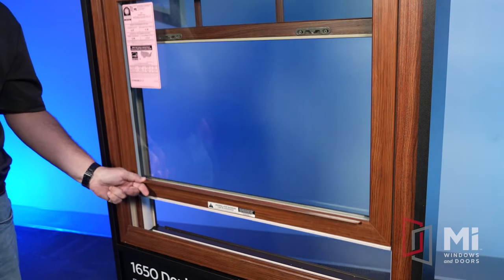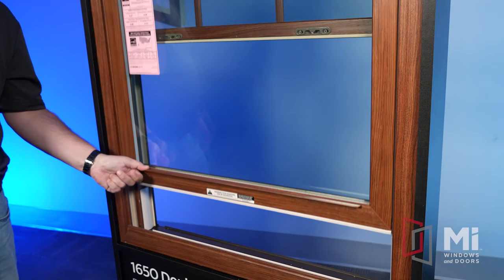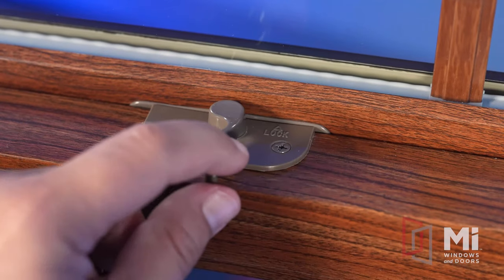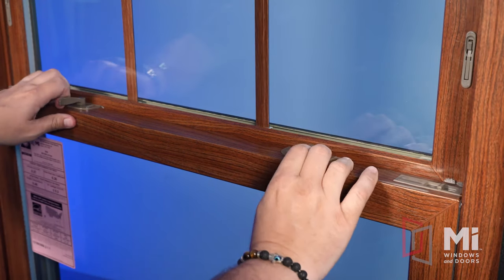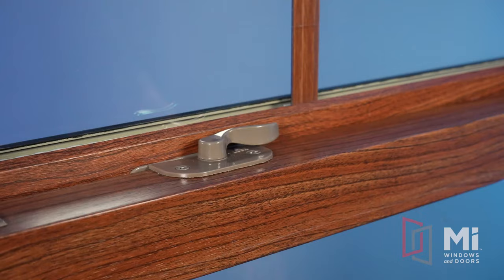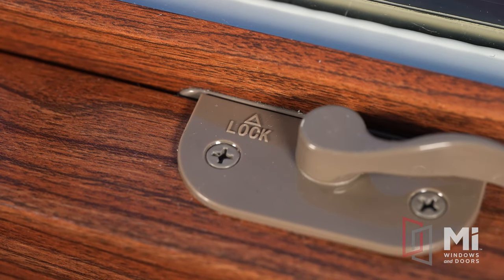The top and bottom sash come with an ergonomically designed integral lifting rail, making it easier to grip the sash and operate it. For peace of mind, the locks and keepers are low-profile and recessed, allowing you to see the view and not the parts and pieces that make up the window. Dual-opposing locks are standard on windows 24 and one-eighth inches and wider, providing better performance and a uniform seal in the center, and reduces the chances of sash racking over time. The lock indicator is embossed on the top of the lock, signifying what direction to lock the window.